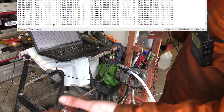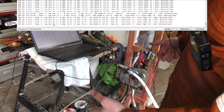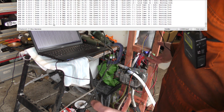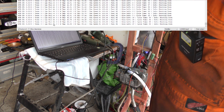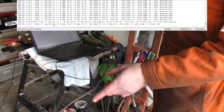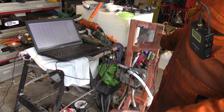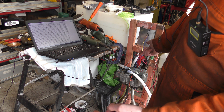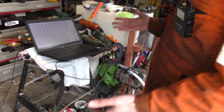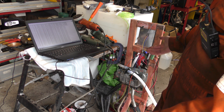So that's where we are so far. A few things to do: get the priming and starting better. It does work — it will light every time. I would just like it to light with as little smoke as possible because if you're on a campsite you don't want to be fogging the whole place in the morning when you're having a shower. The other thing to do is test all its possible failure modes — like if you forget to turn the tap on for the water, will it run until it boils? What happens when it runs out of fuel? These are all failure modes that need to stop people getting scalded or burnt — I want it to shut down in as safe and controlled a manner as possible.